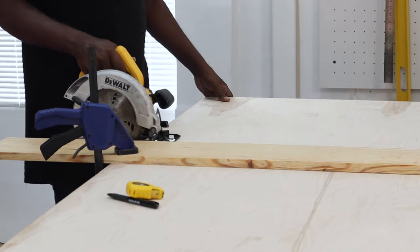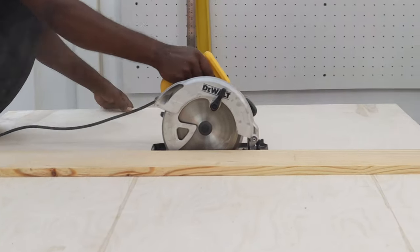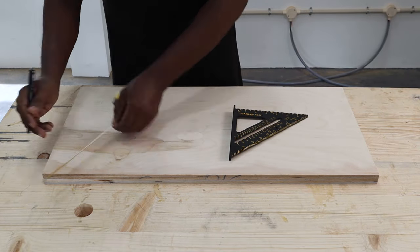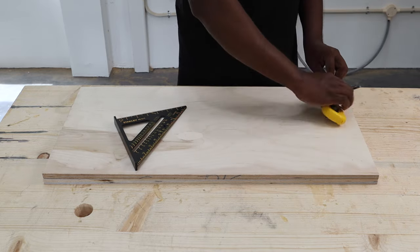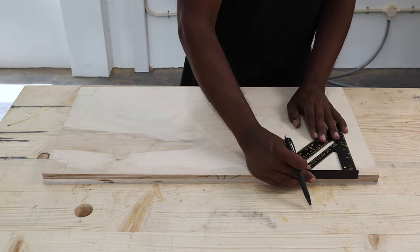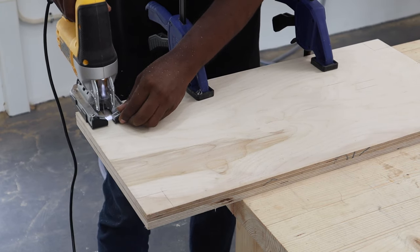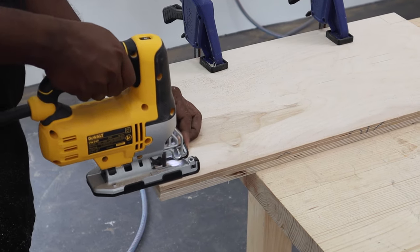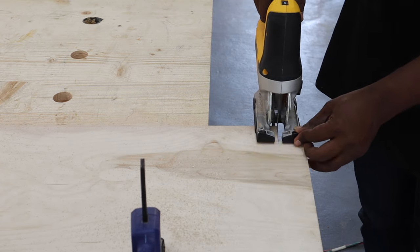The next step was making the plywood shelves for the DIY kitchen cart. We used half inch plywood for the shelves. The size of each plywood shelf piece was 27 and a quarter inch by 13 and a quarter inch according to the plan. We used the circular saw to first bring the large plywood sheet to a manageable size and then did the final sizing on the table saw — this can also be done using a circular saw. After that, we cut out a one and a half inch square on each corner of the plywood piece using a jigsaw to create slots for the four legs. You might notice that we stacked the two sheets vertically and cut them both in one go.